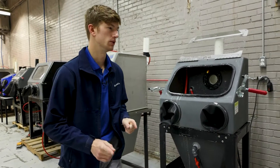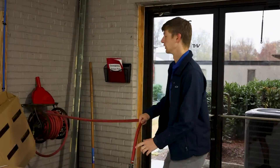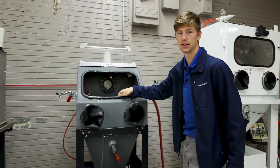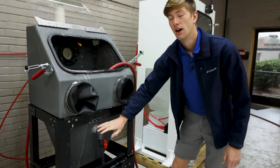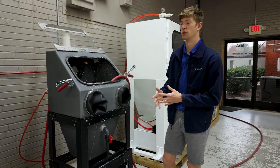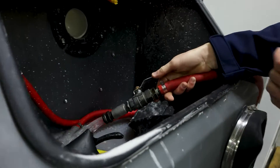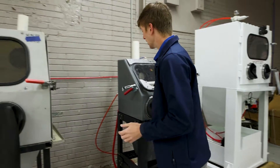Let's hop to actually filling your machine and using it. You can use standard water as long as your pH levels are fine — you can just use a normal pool pH tester kit to test that. When you begin filling your machine, I like to go ahead and open this front ball valve so that as the machine fills up it'll fill over. On almost all of our machines you fill the machine to this top ball valve. You can check our website to see exactly how much water you're supposed to put in your machine.